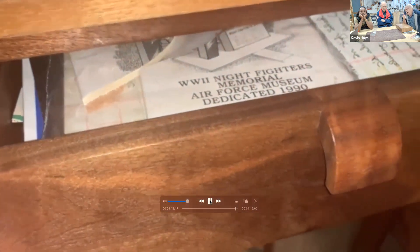That drawer pull is as designed. It's basically made on a router table — I have a cove bit and a big round-over bit. Start with a big block of wood, do the basic shape, then cut them off to the length you want. Mill out a little pocket on top of the drawer and fit it in there. The sides on this one seem to be vertical — you could taper them, round the bottom off. Whatever floats your boat.